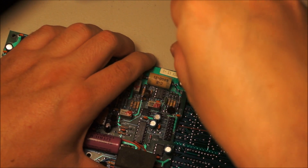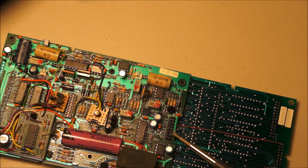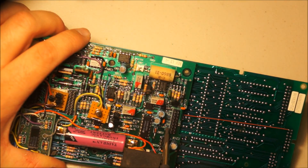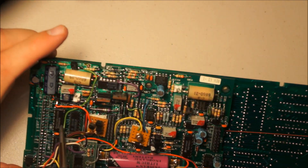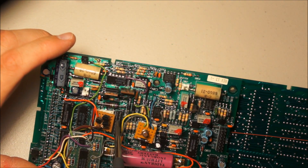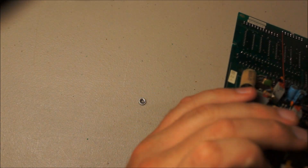That one stayed in — it is a little better installed than any of them. So we can actually see here's the headers for these serial interfaces, and it's actually nicely labeled: Ground, RxD1, RTS1, CTS1, DSR1, and another ground. And then presumably over here this is the other serial port, or the same serial port in two places. This is again held together with lots of little pins.